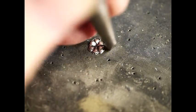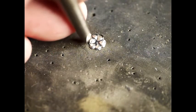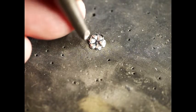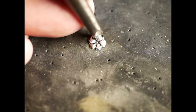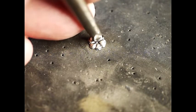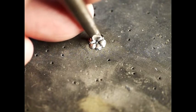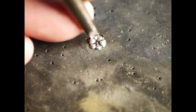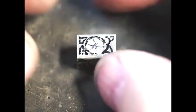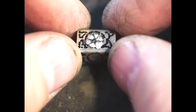And that's a low relief repoussé decoration. It might need a little bit of tweaking, but you can go around the edges with a file to make sure they're nice and round and smooth, which would help the decoration. In this particular flower's case you could get a narrow punch and go into the accent corners at the edge of the petals. We are going to set a ruby in the middle, and the ruby is two millimeters, so we'll need a slightly bigger than two millimeter recess in the center. Obviously all of the felt tip pen will disappear when it gets soldered on.